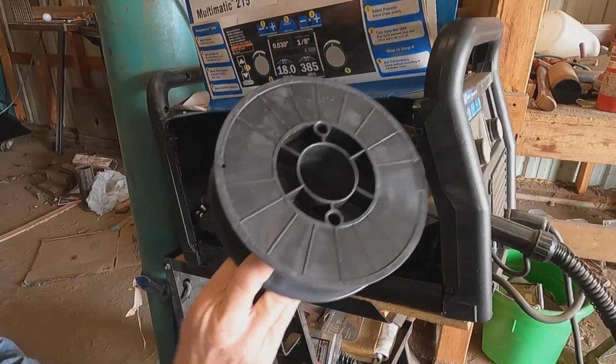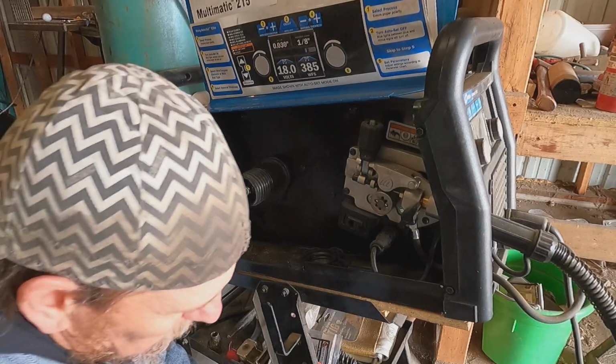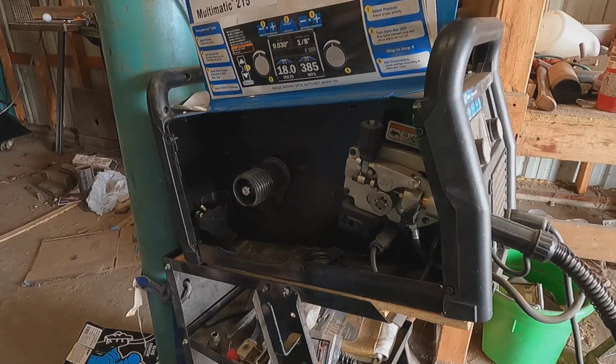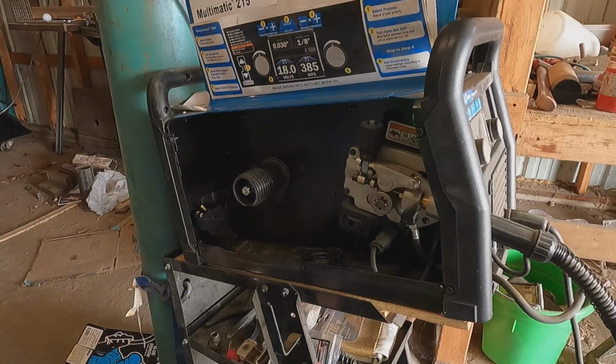And that's our spool that wire was all on. And we got another one hiding down here. It's all plasticed up so that it doesn't rust, because it is carbon steel and it will rust. So, we'll get him all unwrapped. Now they poked the wire through this little hole here to hold it. You want to try really hard not to let that wire get loose on this spool. You don't want it to birdcage on you. Whoa, like I just about did right there.